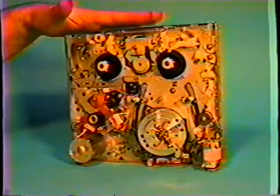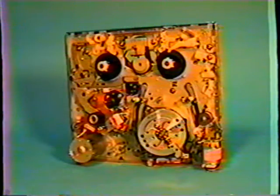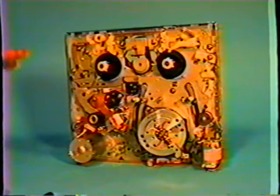Steve, I have my demonstration unit here, and I have it removed from a VCR so we can see all of the points that we want to see and all the parts that we have. You do not take a unit out like this when you're working on a unit because it's too many interconnecting wires that are involved, and there's some pretty delicate adjustments that will be disturbed when you remove them.